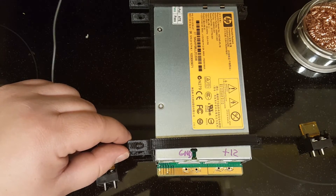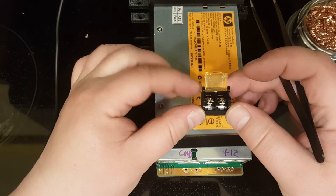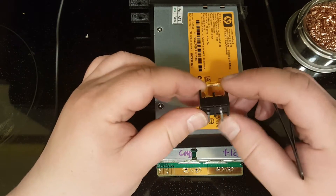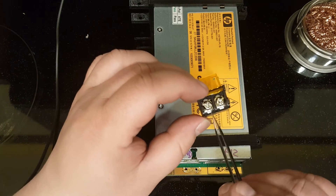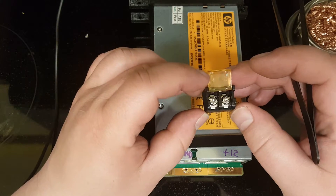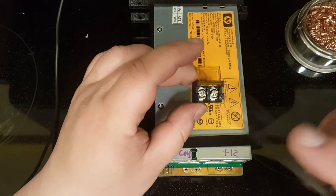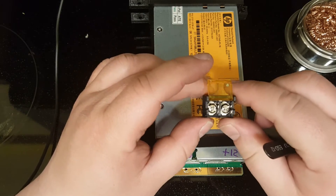I placed them in the center and I'm going to use these screw terminals. I like these - I should be able to just put the wires in and screw them down. That should make a very secure, very good connection, and it gives me the ability to quickly disconnect things should I need to move things around.